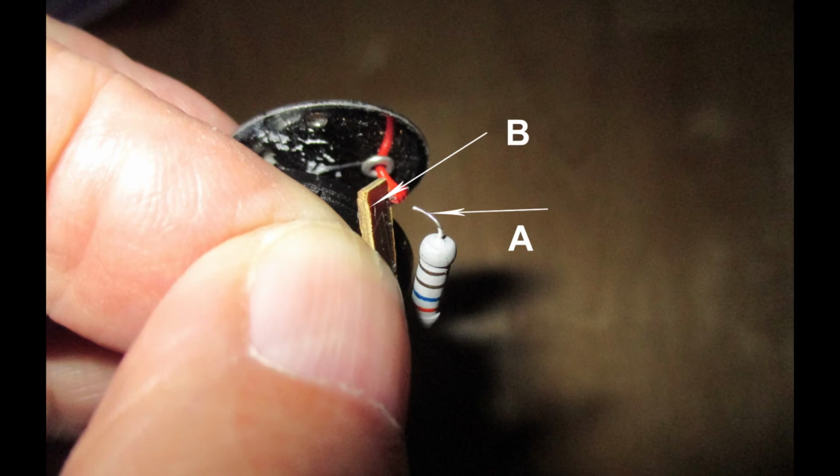Resistors are not easily damaged by heat, but you can clamp those forceps on point A to act as a heat sink that will draw heat away from that wire when you solder it and not let the heat go into the resistor and possibly ruin it. You can buy little heat sink clips at Radio Shack, but a paper clip would do just as well.